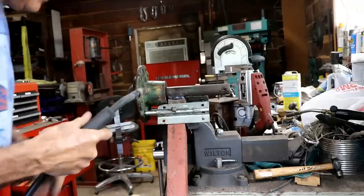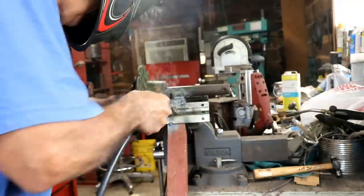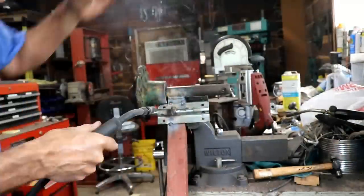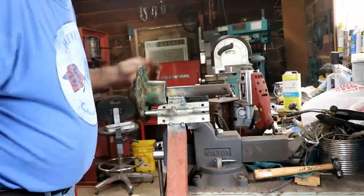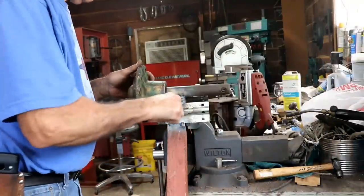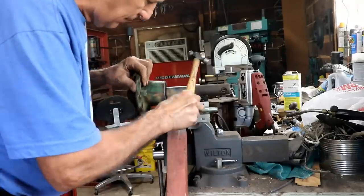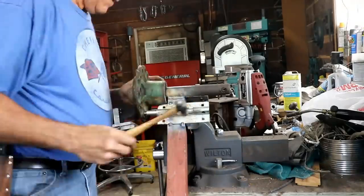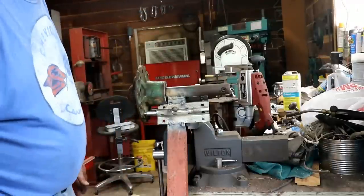Now that drove it down in there further. Therefore I should be able to peen this rivet over and make it stay. I've got this in the vise here — there's a piece of steel under this piece — and I'm just going to try to brad it out. I don't think that'll pull out of there. There's not much force pulling it out anyway, and I think that'll work. If it comes out, I can always thread it and put a bolt in there. This one here seems salvageable, so I thought I'd go ahead and use the original pin. I'm going to try to weld this in place. That's tacked in place. It does seem to be indexed perfectly — seems just perfect, really. I can't see how it could be any better.